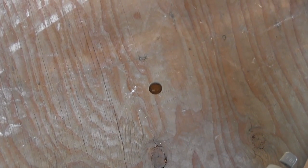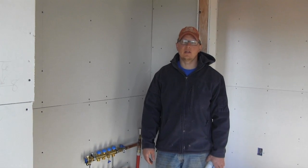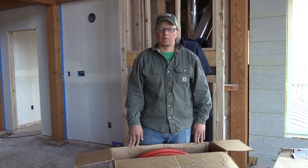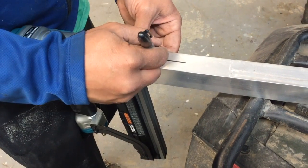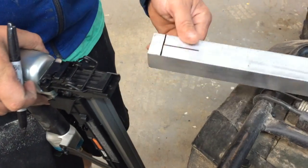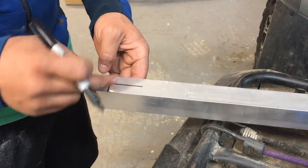I'm a real big fan of radiant floor heat. It's so nice to have heat on the floor — your feet are warm and it's a really even heat throughout your home, very comfortable. Last night I went and modified my tool for stapling down this PEX tubing. I've got a wide crown stapler and I'm making a jig so I can put PEX tubing down. The idea is something that goes on the end of the stapler with a horseshoe shape for where the PEX pipe lays, so when the staples go in they don't hit the pipe.